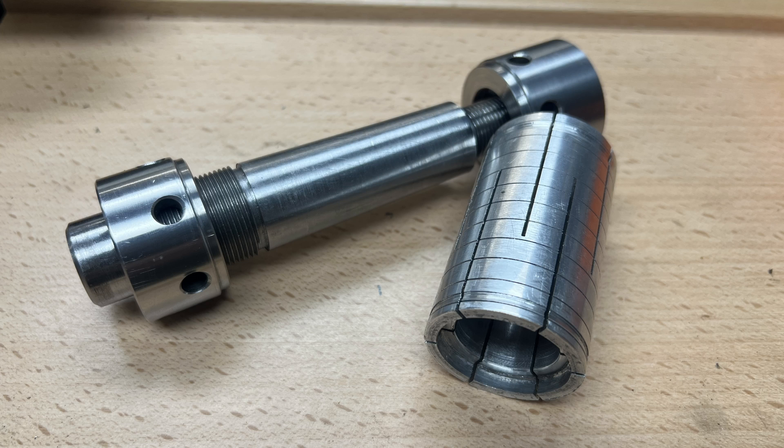Welcome back to the workshop. This week we're continuing to work on our cylinder. I'm going to lap the inside of the cylinder to improve the surface finish. To do that we're going to build a shop-built lap, which is a tapered lap with an expanding mandrel in the middle that we can tighten up.